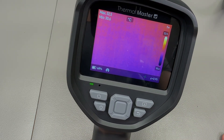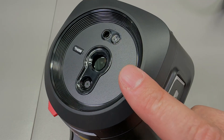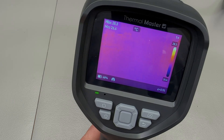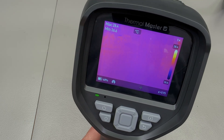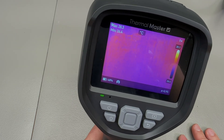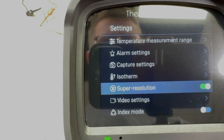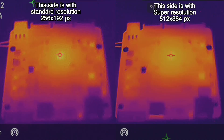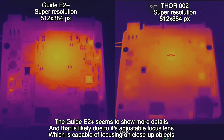The LCD is a 3.5-inch IPS panel with 640 by 480 pixel resolution. The thermal sensor base resolution is the usual 256 by 192 pixels, so it's probably sporting the same IR sensor from InfiRay as the other cameras we've reviewed. This particular model also includes the modern Super IR resolution algorithm running on the internal processor, which effectively boosts the IR camera resolution up to 512 by 384 pixels, giving you more detail in the image. Here are two images captured from the same height over the same subject — an actively running processor on a PCB — and we can clearly see more detail in the image where the super resolution feature is active.